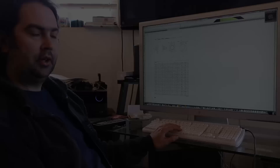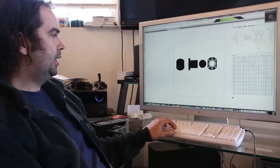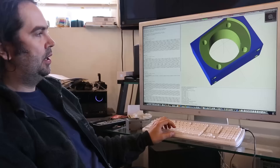The first thing I did is downloaded the dimensional drawings for the ball screw that we're making a part for. Based on this, we had to look up the dimensions and lay out a drawing, which I did in Adobe Illustrator. Then I imported these shapes into OpenSCAD, did an extrusion on a block, then extrusion on the outline parts, and then did a Boolean operation. There it is in OpenSCAD. And then next we did a 3D print of it.